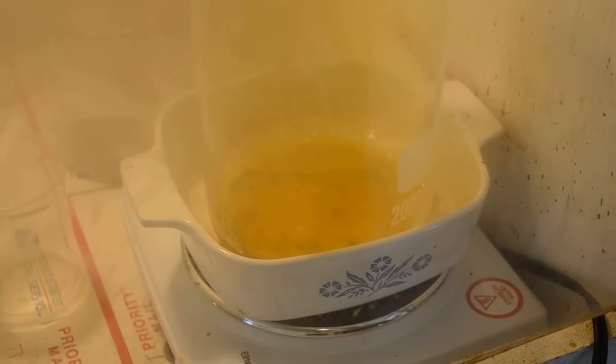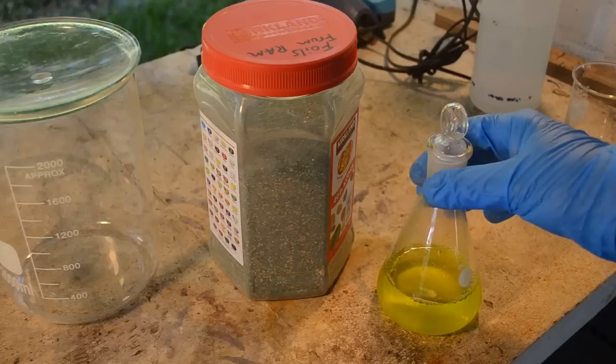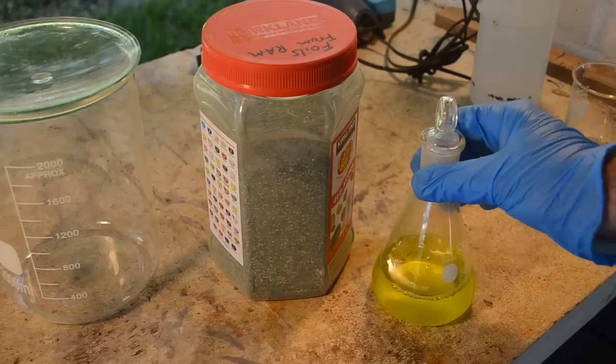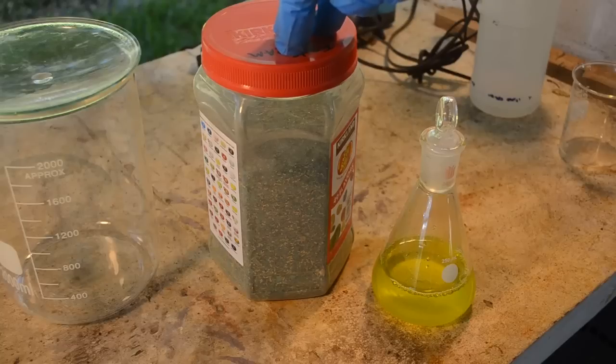This stuff has gone back into solution nicely — that's a much better looking solution than what we had before. It's the right color, nice and clear. I'm going to put this aqua regia solution in a temporary storage container and set it aside until all the rest of the stuff is processed, then we'll combine it all together, drop it, and have all the gold in one place. This is cleaned up pretty good — good looking stuff. If I drop it again I'm sure it won't be colloidal anymore. It was a nightmare to process and I can't do the rest of that the same way.